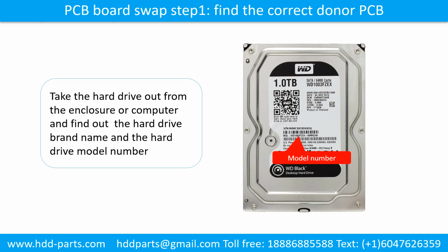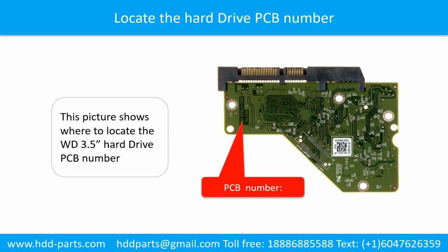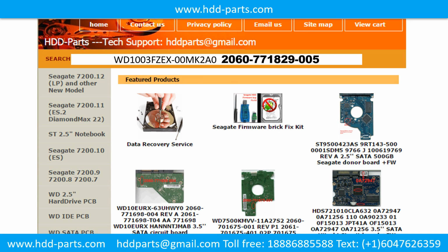Locate the hard drive model number on the front of the hard drive label. Locate the hard drive PCB board number. Different brand names have different PCB boards. The PCB board numbers are different. You may go to hddparts.com to check out other brand name PCB board numbers. We use the hard drive model number, PCB board number, PCB board sticker number and CPU number as reference to search for the donor PCB board.